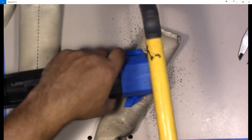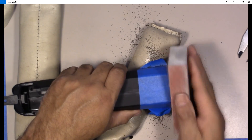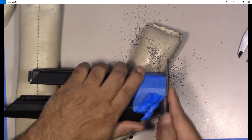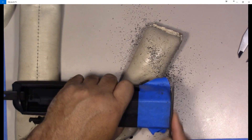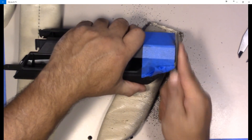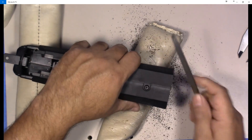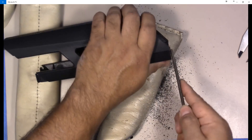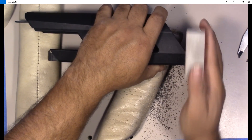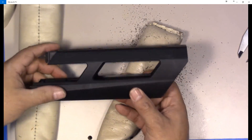I'm laying it on the left, laying it on the right to make sure I'm keeping that line completely straight going all the way down. Then I'll use sanding blocks to get the edge level. Files are more aggressive and do a better job taking off bigger pieces of material, so I'll use some hand files to get that profile as straight as possible. Deburr all the edges, work the inside edges, and just clean this up a bit.